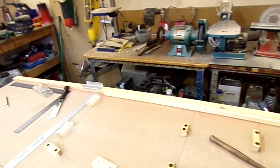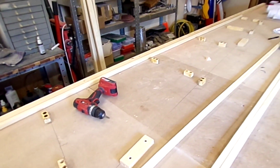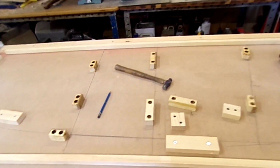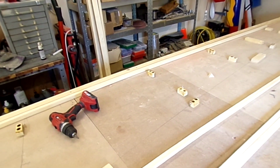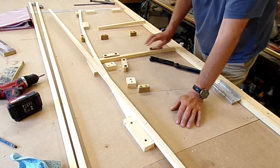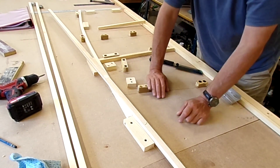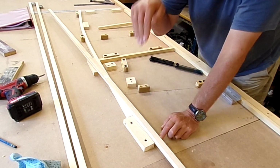Note, the straight edge along the table there is my upper datum, and then all the blocks of wood are around the periphery, the outside of the fuselage side, because that's the critical dimension. And the other blocks are in to hold the uprights or near upright sections into their relevant positions, again in their sort of critical places. So I've got a vertical piece here just acting as a basic packer. It's a piece of the 3/4 which is not good enough, it's got too much run out in the grain. But that's just acting as a temporary packer, and I'll use that to make up maybe a pattern further along. The lower longeron here I've orientated so the growth rings are going vertically as we look at it.